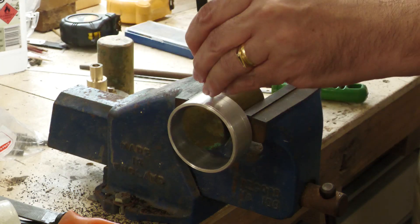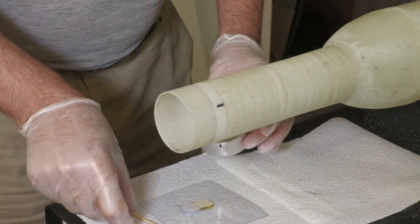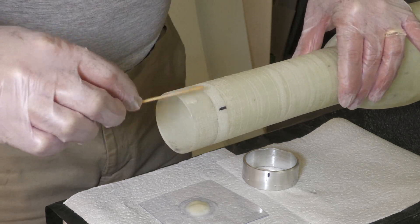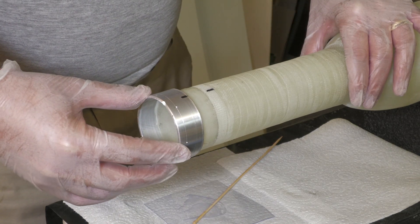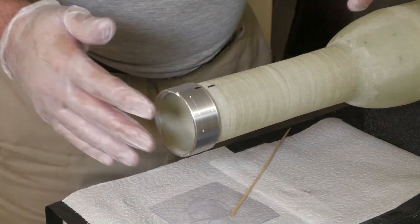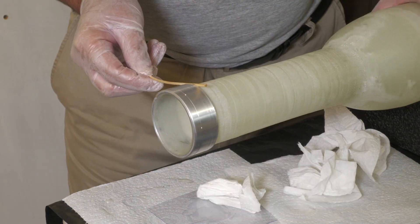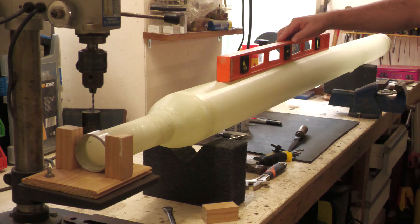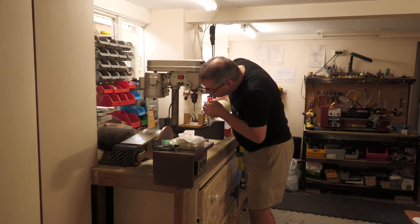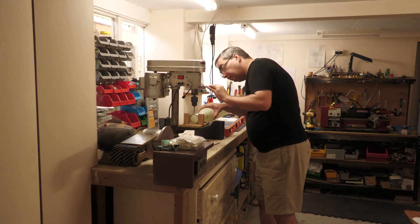We punched out the centers for the screw holes, then glued the ring onto the end of the motor tube. This ring provides the shear strength for the screws that hold the nozzle in place — without it the screws would rip through the relatively thin fiberglass tube. At 400 psi there would be about 700 kg of force pushing on it. To attach the nozzle we drilled holes through the retaining ring and tapped holes in the nozzle, using a wooden jig secured to the bench drill to align the tube with the drill centerline and control depth.